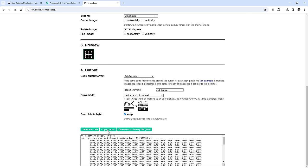With everything working, I copy the code to the Arduino IDE. The sketch also uses the gearBitmaps.h file, so I create a new tab by clicking the three-dot menu, selecting New Tab, entering the filename, and pasting the content. Then I upload to the real Arduino. When no magnet is present the display shows neutral, and moving the magnet around switches correctly through 1st, 2nd, 3rd, 4th, 5th gear, and reverse.